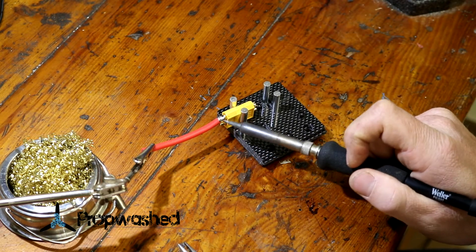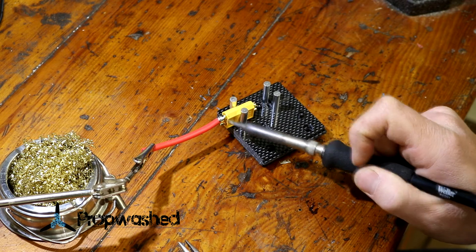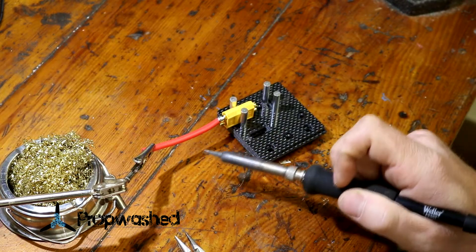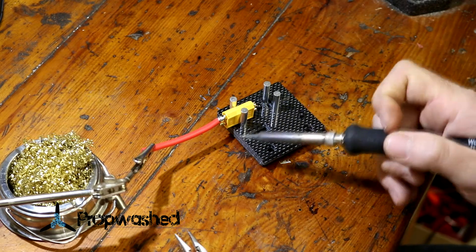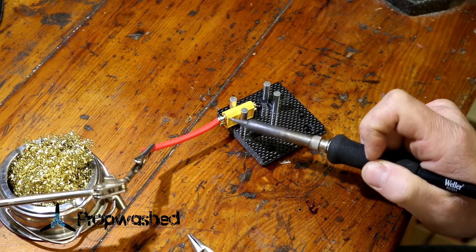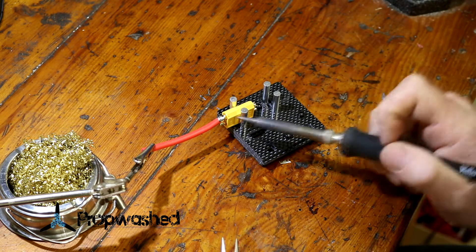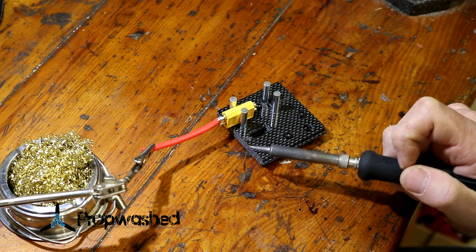The idea is you want as much solder on the threads as possible and you want it all made into the connector, because you're trying to get as much power out of this connector as possible. Our mini quads are running about 100 amps — that will get you more power to the props, more thrust, more performance. So a good soldering job is very important there.